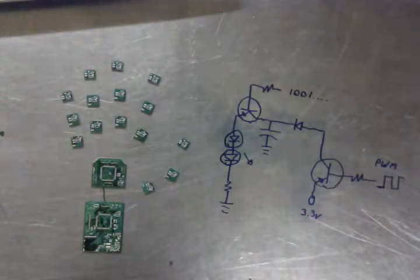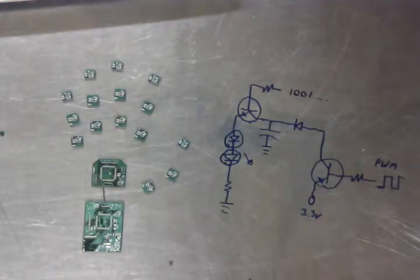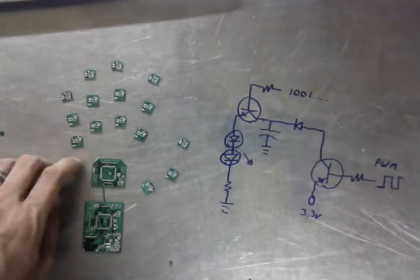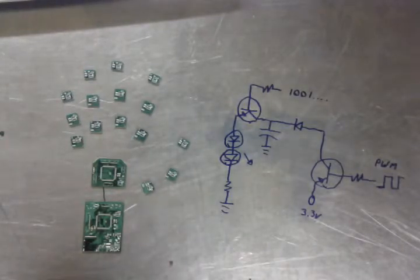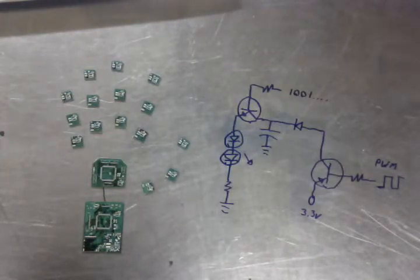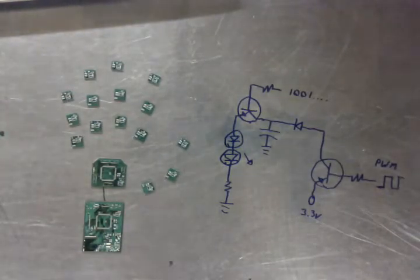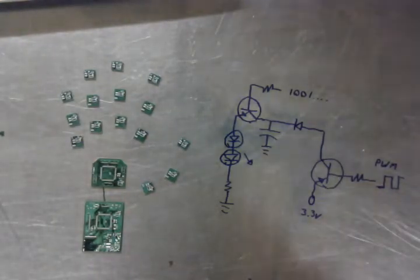So the strategy is going to be to use a counter and the oscillator on the CPLD board, which I got to be very, very high accuracy, to actually drive an IRDa PHY in the CPLD, which shouldn't be too difficult considering a lot of the schematics that I saw that manufacturers had posted about how their own products worked. So I'm reasonably confident that I can get that done without much trouble, and with probably only 10 flip-flops. Actually, it would probably have to be 20 if I wanted that rate to be settable via SPI, which is also on the table.